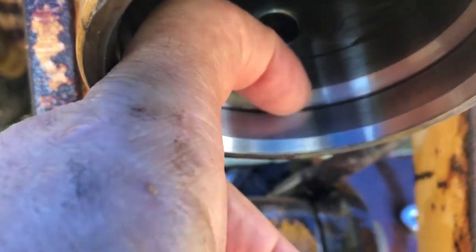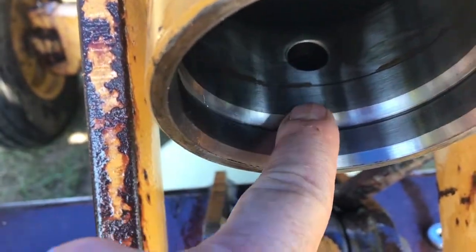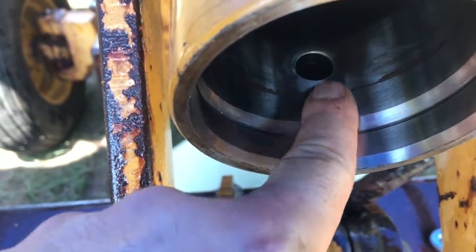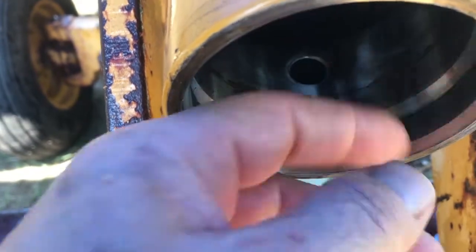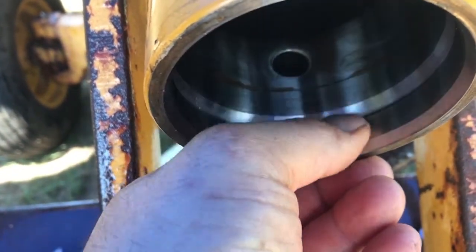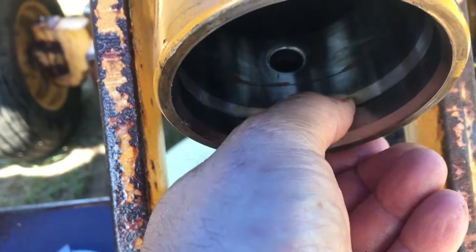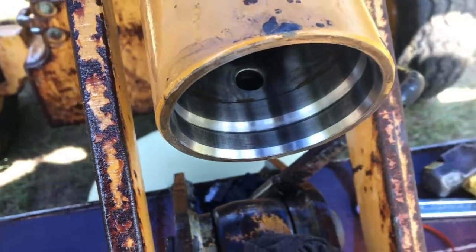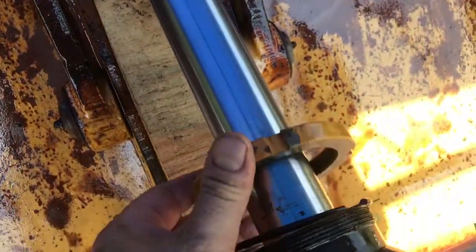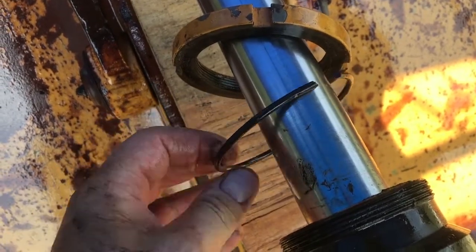This groove is designed to clamp this way. It's tapered going in. It will make sense, so when you push the new packing, it will glide or slide on this. However, this edge over here, it's a little bit sharp. This will keep it from coming out.